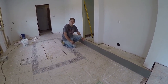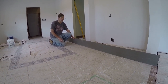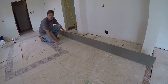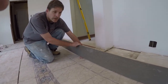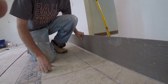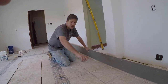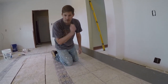Hey, this is Dave and I'm with my brother Rich. Today we're working on the floor and I thought I'd show you how we're going to put floor leveler on this floor. As you can see, this is an old tile floor that we're going to cover with engineered hardwood, but it's sunk in a bit in this one particular area. I can get my hand underneath here. I've already taken a board and gone through to find the low spots and the higher spots, and I've drawn a circle on the floor to show the general area where I want the leveler to be.